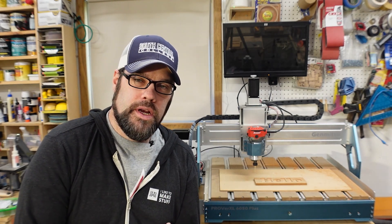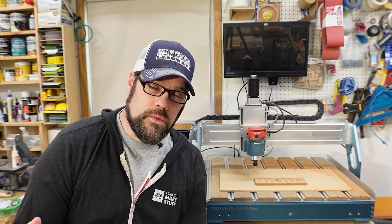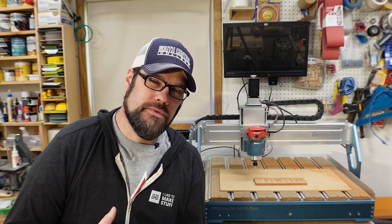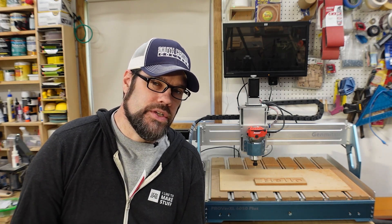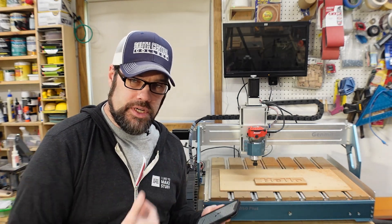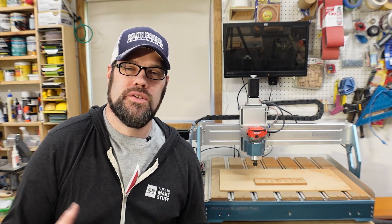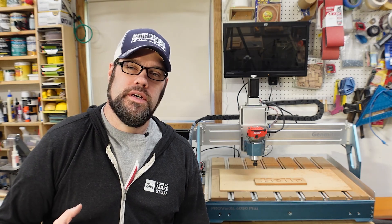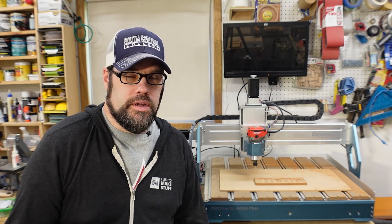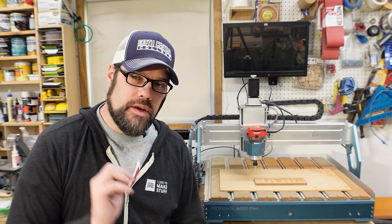I have it on my IoT network — it connects similarly to many other IoT-type devices — but when I tried to put it onto my dual-band or tri-band network, it just wouldn't connect. I didn't want to go through the hassle of trying to force it down to 2.4 GHz. The 2.4 GHz network is easier to penetrate into dirtier, harsher environments like your shop, and it's a cheaper way to implement it — so it's annoying but not a deal breaker.